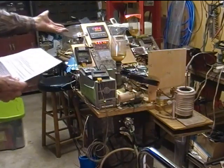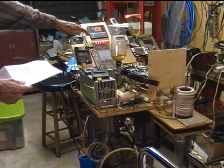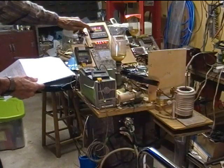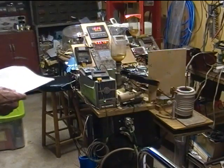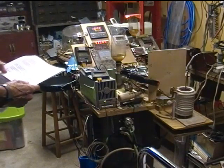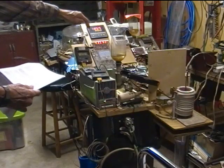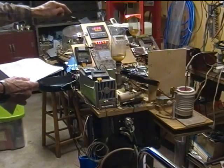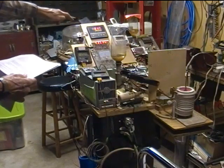After all was said and done, all I had to do was wire it up and plug it in. You push the set button once, and when the SV green display starts to flash you just use the little arrow keys to pick the temperature you want. Push the set button again and you're ready to go. There is just a relay output here that turns the heat on and off, and those relay contacts close as soon as you power it up — so be prepared that you will get heat at that time.